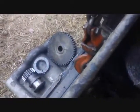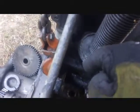Now I got that other bevel gear off. And now because that bevel gear dropped down, I should be able to raise this up and slide the saddle right off. Oops - I forgot the saddle can't slide off because this piece moves with the saddle and it's going to hit here, so I've got to get this bracket off first. Now that I just removed that gear, I can see the four screws right there that hold it on, so I'll get those out.